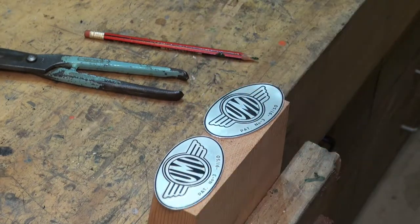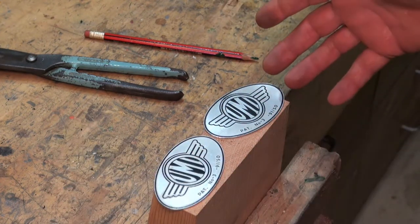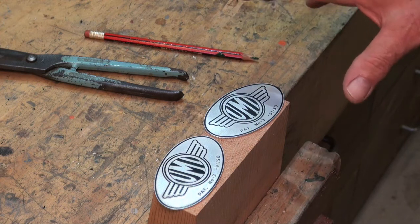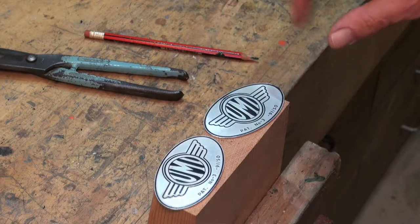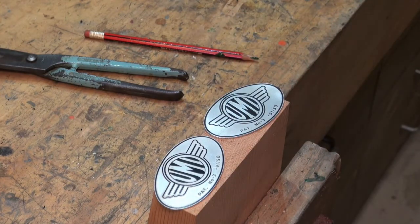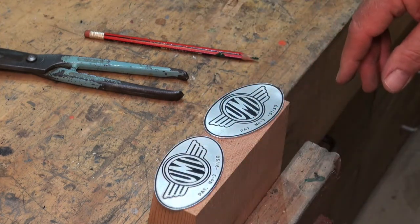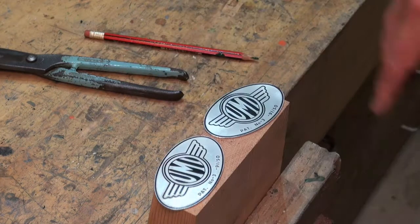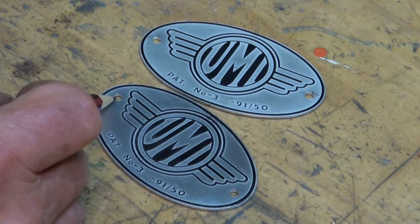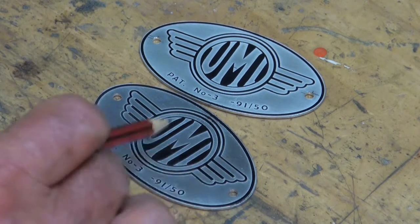There's two. If you want these to be more decorative, you can clear coat over the top with the DIY powder coat gun — that adds a further protective layer to the aluminium substrate and also gives it a glossy texture. In the situation I'm doing this in, this needs to look more like the original material, so I'm going to leave it with that dull grey aluminium look. I've drilled a pair of 3.5mm holes in the outer extremities and I want to hold this onto the body of the laundry trolley with rivets.